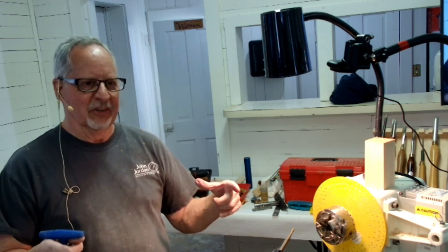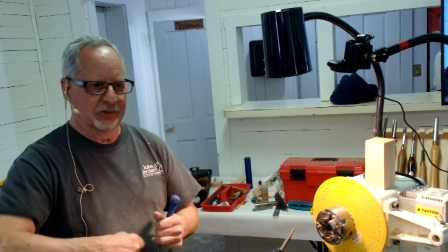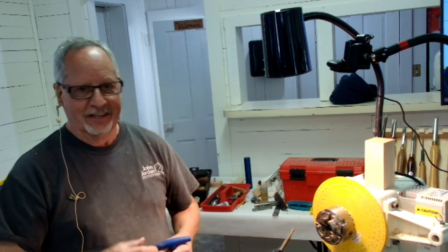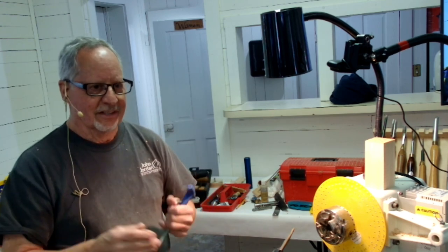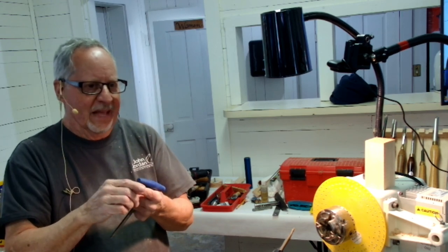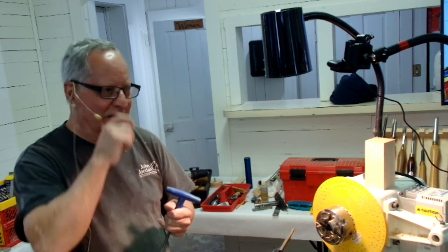All kinds of things. Got an electric skillet. I heat paraffin wax. It's full of melted paraffin wax all the time. Heat that up, dip the ends of green wood in there. Much faster than trying to paint it. And it works great. I dropped it one day. It splashed on my face. As it was coming up, I'm thinking, oh, this is going to hurt. Nah. So what you do is you turn the skillet up until it just melts, about 160, 165 degrees. And that's hot enough. The hard part was getting it out of my mustache. It didn't burn my face, but boy, it was hard pulling out of there.